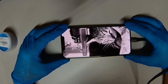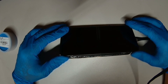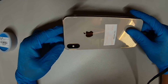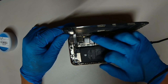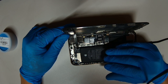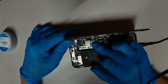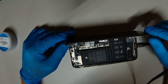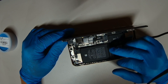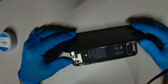That's how we fix the touch issue on this iPhone XS Max. It looks like the phone was dropped and there was some previous repair done on the back glass. That separated the top board and bottom board so the connector pins were not connecting. We touched up the pins and fused it back together and it works fine now. Before doing that, we measured circuits around to confirm they were connecting properly.